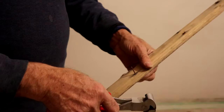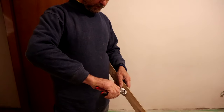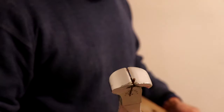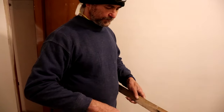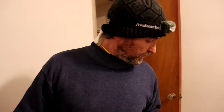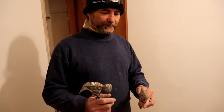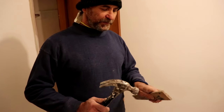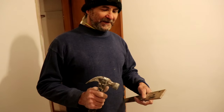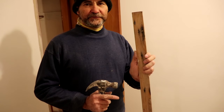Don't bang the nail back — just pull it all the way through. The head of the finish nails is very small, it goes through and doesn't leave much damage on the good side. Let me get a hammer and show you: we use the plier that way we don't damage the finished side. I'm gonna show you on a piece that we're probably not gonna use — how if we bang this nail back, what happens on the other side of the board.